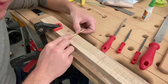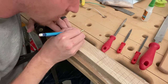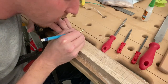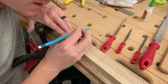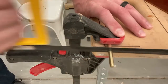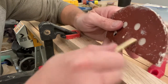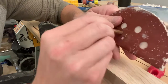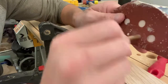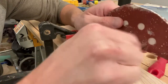Now I'm going to set this hinge pin in place — it's holding firm right now without any super glue, just in a little pocket. I'm going to mark where I want to cut this off at. I want to leave about an eighth of an inch of overhang — you don't want to leave too much. Then I'm going to clean up this rough cut using a little sandpaper. If you have a belt sander handy you can just touch it on there, but I'm showing you that you can do this just with hand sandpaper. Just work that edge so it's not so sharp.